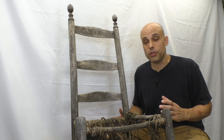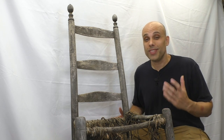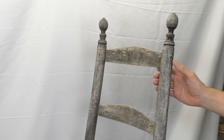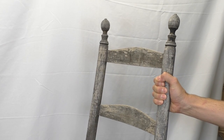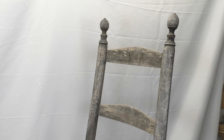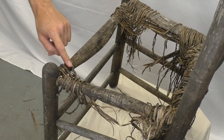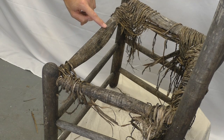The timbers you choose for a project like this have a big impact on how you make it. Whoever made this chair didn't have access to fancy tools or expensive woods, but they understood different timbers, their properties, and where to use them for maximum effect. Most of the chair is cheap silver maple and the pieces for the posts and legs are left thick for strength. The stronger, more expensive oak is reserved for those spots where strength is essential.